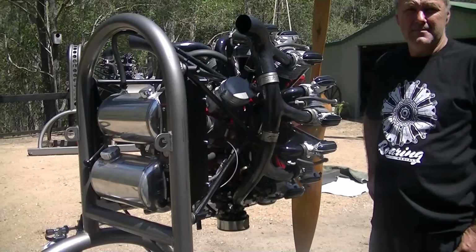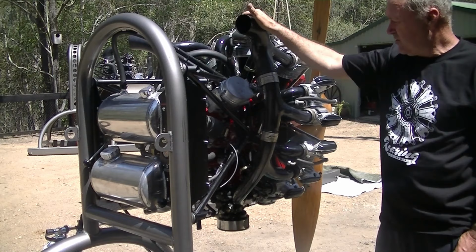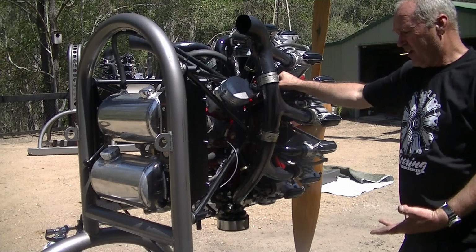Okay, so over the opposite side of the engine now. Another exhaust outlet, I think it's three or four cylinders this side and the opposite the other side. The other magneto. This has also got the compressor this side. So when this engine was in the aircraft, that compressor would pump the cylinder to replenish the air taken to start the engine. I don't use it because I don't run the engine long enough to replace the air that I use. I fill my cylinder by an electric compressor.